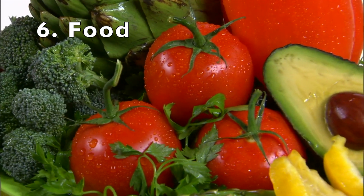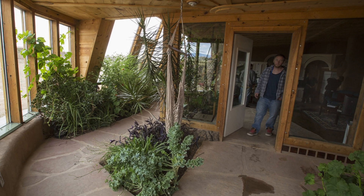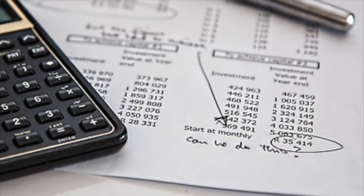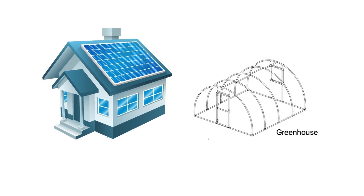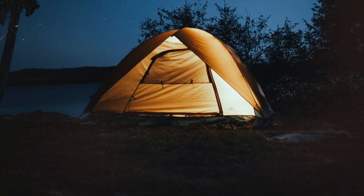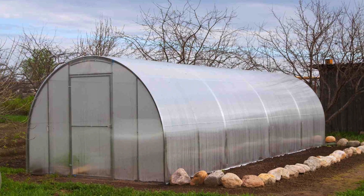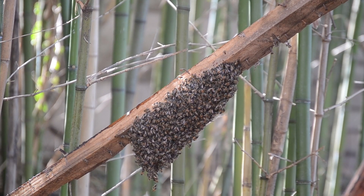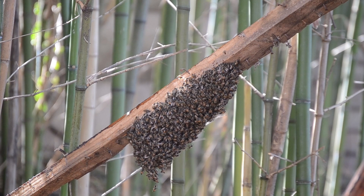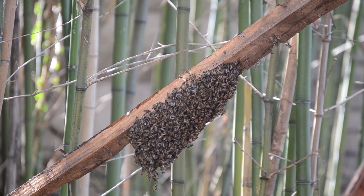The last topic is food. It's really cool that earthships incorporate growing food into the square footage of your home — it looks great — but the reality is when you increase the square footage of your home, most municipalities also massively increase your property taxes. The cost of the greenhouse is exponentially higher per square foot of growing space if it's part of your home versus a standalone tent-type structure beside your house. A greenhouse can be made with double-wall air-inflated poly and insulation on the north wall and classified as a tent — something that isn't taxed much in any municipality — giving you a much larger greenhouse for way less cost. You also avoid all the bugs and humidity associated with growing an abundance of plants in your house. A full orchard growing foods is an invitation for insect infestation in your home.